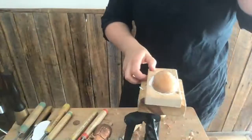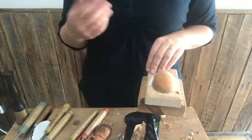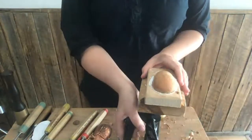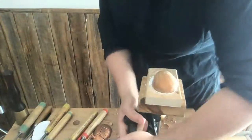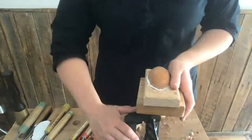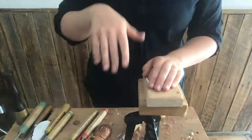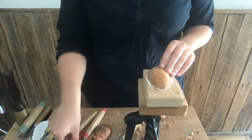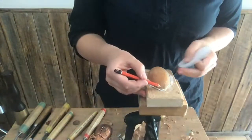I used to use Japanese water stones, and if you drop one on the floor and you've got a big ding out of it, that's a problem. I used to use water stones, but then I progressed to diamond stones. They're a bit more expensive, but the water stones will get grooves out of them where you've been sharpening over time, but the diamond stones do not.